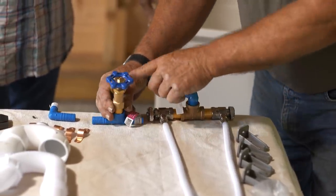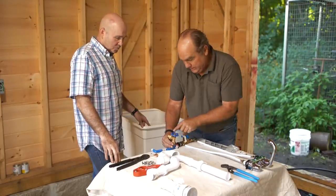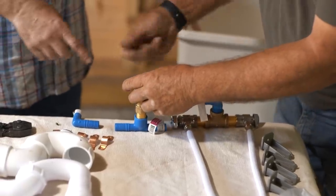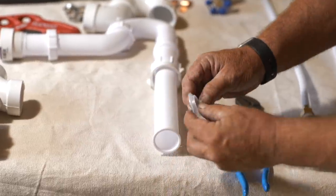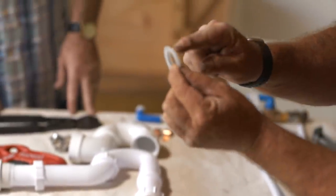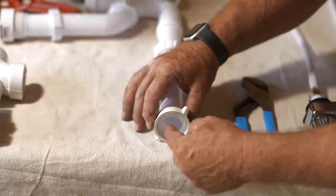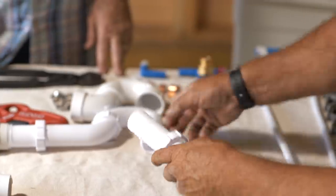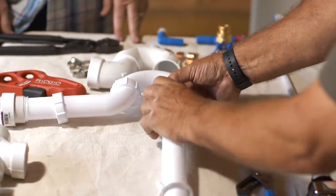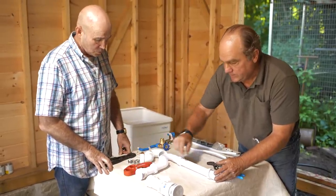What I have done is added a T with a draw-off right here. So you could have an adapter onto a spout, but the spout is so lightweight construction. This will give you a really solid place to connect the hose if you want to hose down the area. On the drain side, it also comes as a kit. Right onto the bottom of it, you'll make this connection with a thing called a tailpiece. There are a couple of different types of gaskets — this is called the top gasket, the one you don't want to lose, because this comes up and compresses against the bottom of the basket strainer or the bottom of the sink. The rest of them are regular compression nuts that come together and you compress the nut to make it tight. So we'll modify this for length using this really cool tool that will cut it exactly right.